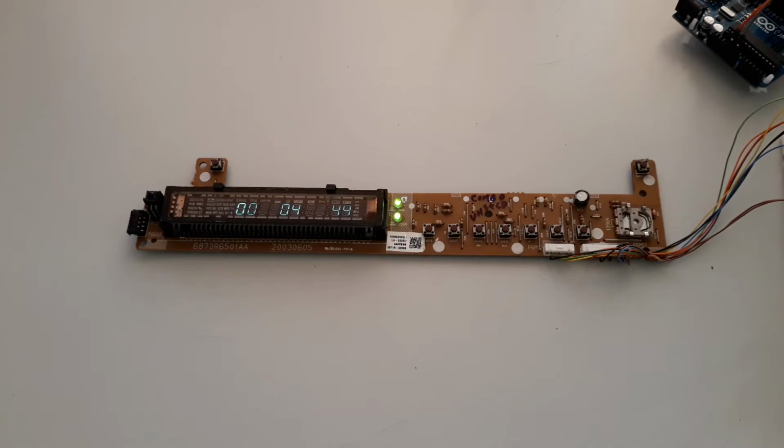I bring this not for the driver itself, but through a simple power process with 5 volts DC. Most of the requests for help are related to how the VFD driver is powered. So today I suggest two DC-DC converters. One is 5 volts to 5 volts DC, okay, a 1 to 1 relation. And the other from 5 volts DC to 24 volts DC.